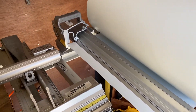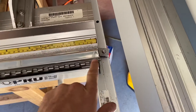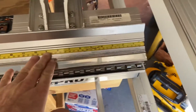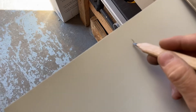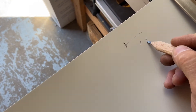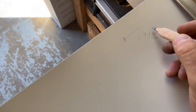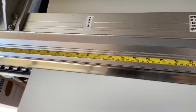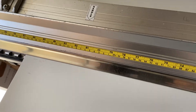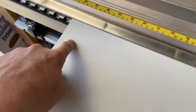With the Caddy Shack and this whole setup, the way it works is you have your cutter, and it cuts an inch and a half back. So when you feed the metal in — it has a ruler right here — if it says 71, you're going to cut it to 69 and a half; you go back an inch and a half. So say this is my last mark right here — you measure up one and nine sixteenths, make another mark, and when you put this in here and clamp it down, you clamp it right on that line.